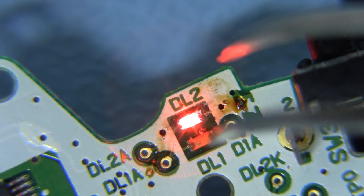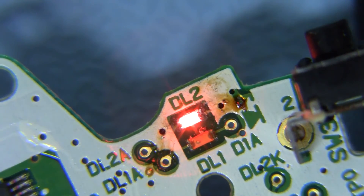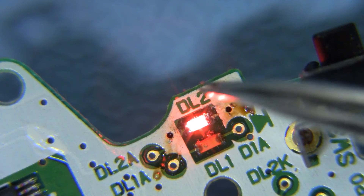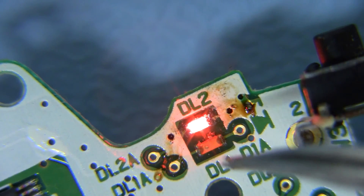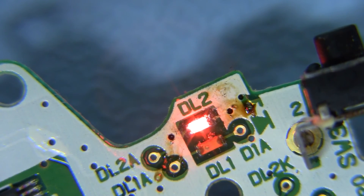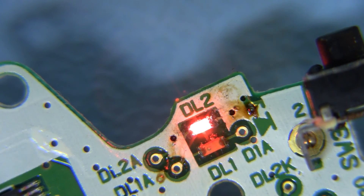The easy answer is: if it doesn't work one way, just do it the other way. This is a lot easier to do with hot air — at least for removal, hot air makes it super simple. But it is possible with just an iron. If the pads were longer it would actually be a lot easier — you just fill up each side with solder and sometimes you can bridge over the part, keep heating both sides, and it'll come off. On this one that's a little too hard. Instead of a puddle of solder, I used a puddle of flux. My favorite saying is: if your soldering isn't going right, just add more flux. Try the wire trick, and use a thicker wire than I did — something like 14-gauge solid copper wire would be better. Hopefully that helps some people, sorry I couldn't make this a bit more fancy production.